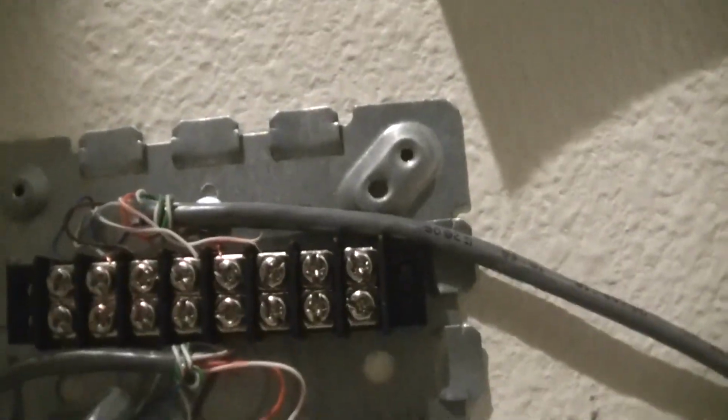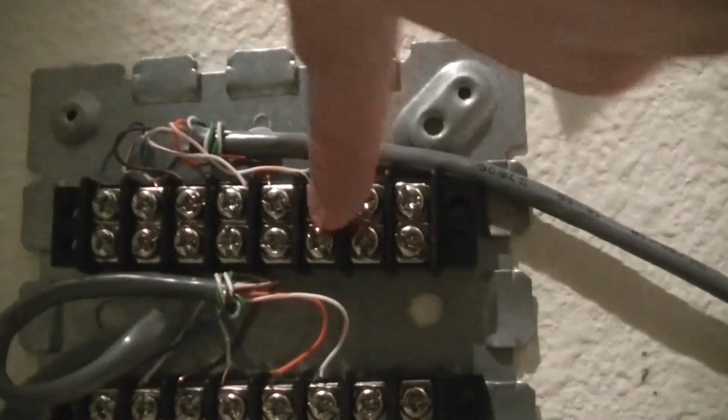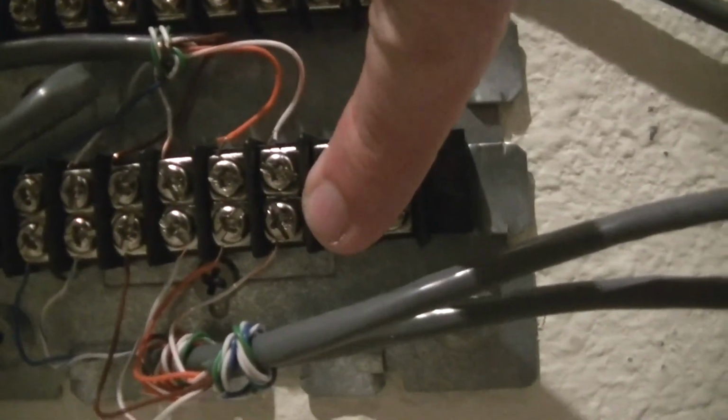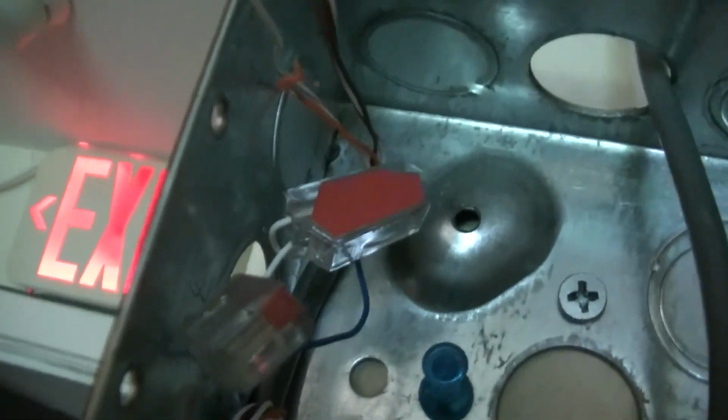And basically what I have been doing down here in the junction box is I have wired up the cable coming from the junction box to the bedroom devices. That's all wired up. I have the cable going into the hall wired into the hall's terminal block, so I do need to run the bedroom's cable to cover the zone and the NACs. I have this pull station up, so I've run this wire and have it all connected and junctioned in there.